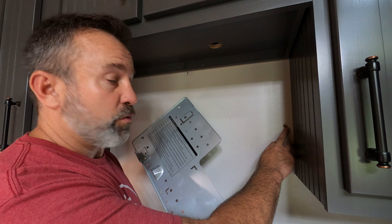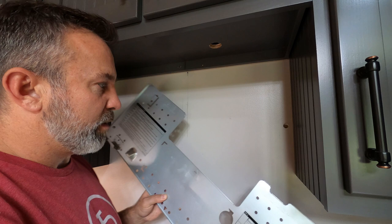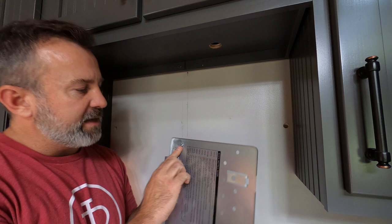The good news is I was right on the edge of the stud there so I won't use a toggle bolt — I'll use a regular lag bolt. I got just enough wood to get that in there. So: toggle bolt on this end, lag bolt in the center, lag bolt on the edge. I went ahead and started my toggle bolt so I can push it in the wall, tighten it up with a Phillips, and we should be good to go.